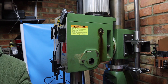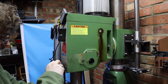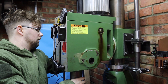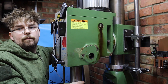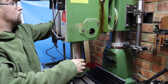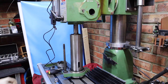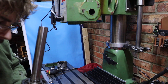We'll take a look at that a little later in case anyone wants to see the quill handle mechanism internals. Now the quill should just drop out the bottom — and it has dropped. I raise the head up a little because the quill is resting on the base of the table, then we raise the head back up and — we have one quill removed.